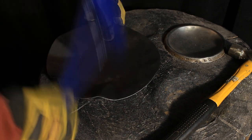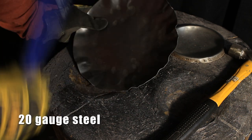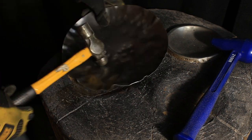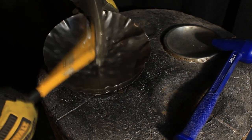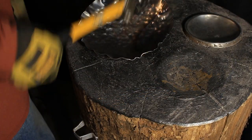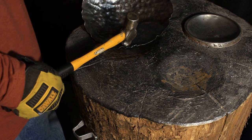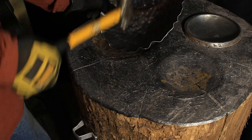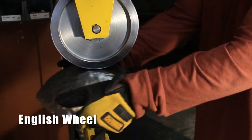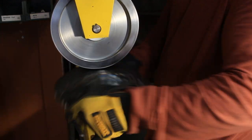I could have used anything to make this part, but since I am a metal worker, I chose metal, just because I understand it a little bit better than fiberglass and other materials. This is how I start all of my shoulder armor or helmet armor projects. This is 20 gauge steel that I'm working with, just stretching it out in the center on the dishing stump, and it's actually shrinking it on the edges as well. What you see me making in this video is not the actual armor that will be the end result — this is just to make the molds. This video is focused on making the molds to make bulletproof armor, not the actual armor itself. That's for the next video.